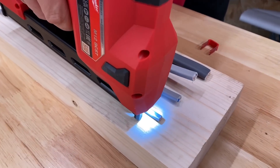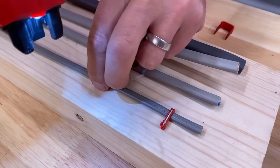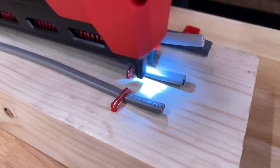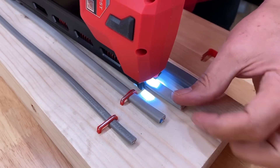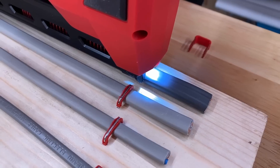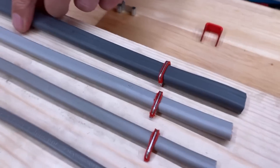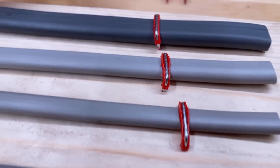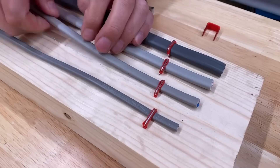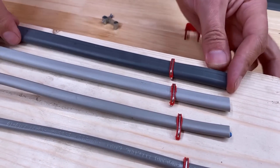Starting with a 1mm squared twin and earth — and you can see that's held with just light pressure. And again, let's repeat for the 2.5mm. Stepping up to a 6mm. And this gets a little bit cosy because we've got a 10mm squared one here, so it's just fitting inside the clip. And all of those are held just with one clip — pretty secure. I can pull that out, but I'm having to pull quite hard. They're well, well held.